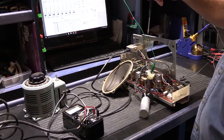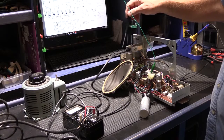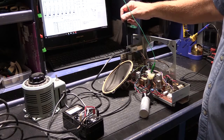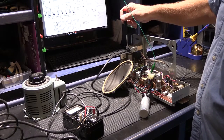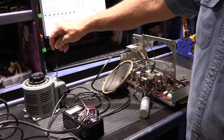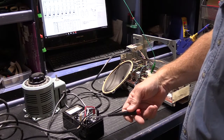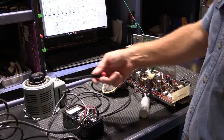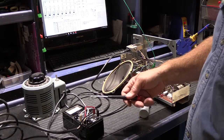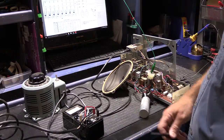What I've got set up here is the master station. These base models have a 110 power plug-in and there's a special adapter cord that you use for these models. It's hooked up to my Variac variable power transformer and my Simpson 390 volt and amp meter. These pieces of equipment are necessary to have when you work on these base models so you can monitor how it powers up and make sure you don't have any fundamental problems.